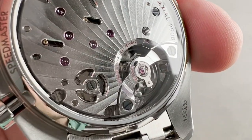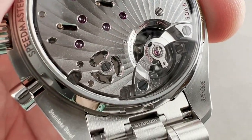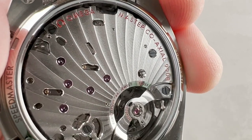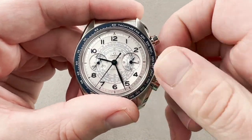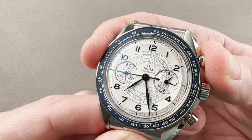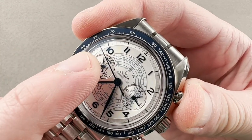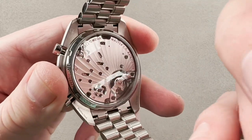On the back you can see the reason Omega is able to make this watch thinner — the new manual wind version of the 9900 caliber. It's caliber 9908, twin barrel, manual wind, doing away with the winding bridge and the rotor. Still a 60-hour power reserve, it still has a number of subsidiary setting modes from the automatic version of the movement, including a time zone feature that allows you to set your local hour separately from the rest of the watch, a hacking or stop seconds function, and crisp column wheel function selection. You get a nice sharp report when you press the start-stop trigger, and with a vertical clutch there's no jump to the start of the chronograph seconds hand — you can leave the chronograph running full-time without hazard. It's a robust sports watch architecture.